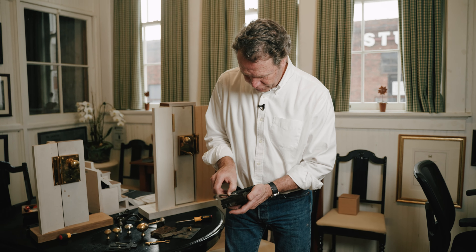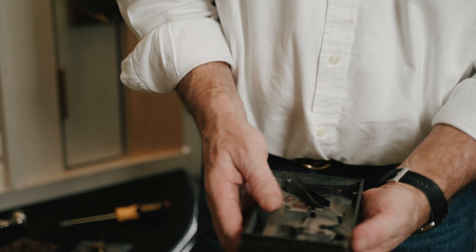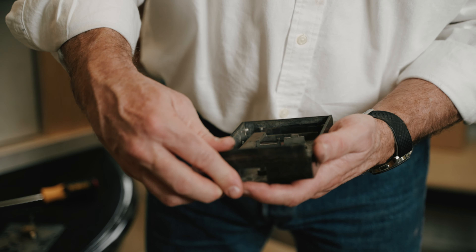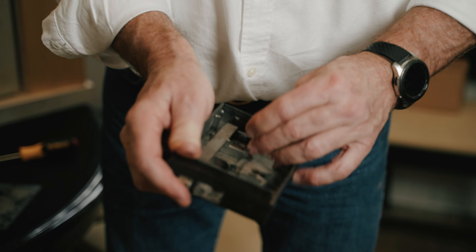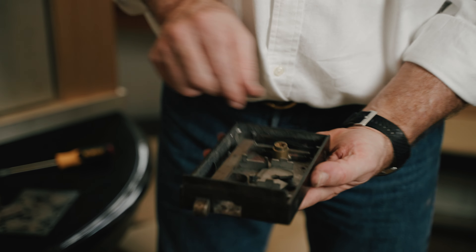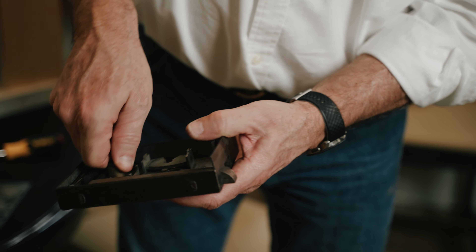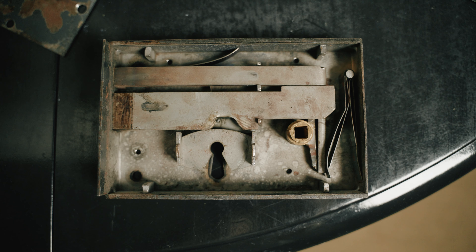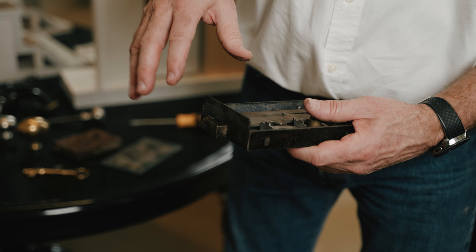When my lock goes in back here, I'll put it behind these springs. See how that - what's happening there? This is getting pushed. What's going to keep it in place? That's where this little key cog is - it's going to drop in here and that holds it in place. If that wasn't in there, it kind of springs out too far. This is holding it in place. And then when I open or close my door, see what's happening? It's pushing against those springs and moving the catch back and forth. It looks kind of scary when you open it up, but it is just springs and latches that are mechanically put together. When my key comes in here, it moves this thing back and forth and causes my deadbolt to open or close. I think it's fun the way it's put together - it's kind of a puzzle.